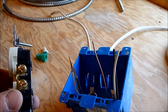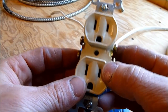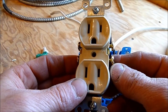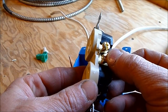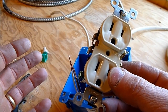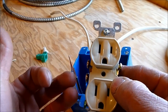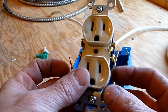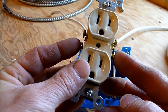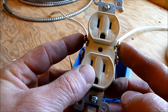To make this realistic, let me talk about how circuits are put together. If this outlet is at the end of a circuit — the last outlet in a line — you'll just see one wire on each side: a black on gold and a white on silver. But if this outlet is in the middle of a circuit, you'll have a black and white feeding the two bottom terminals, and a second set of wires feeding the next outlet. That's how it runs in a series.